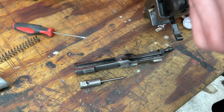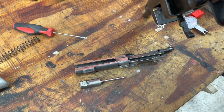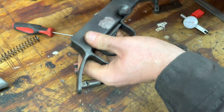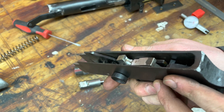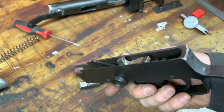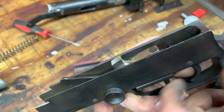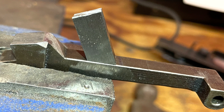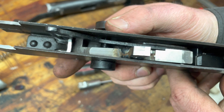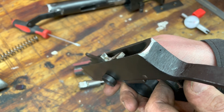I've been working on this for about four hours tonight and it's just about midnight, so bear with me. As you can see, the factory sear is gone — it's right here, it's still hot, it's gone. Used to be back here. I put a new one — recreated the angles about a little bit over an inch further forward, then welded it to the sear lever. Pull that down and it trips just like the original.